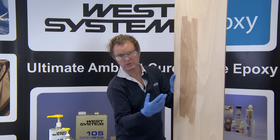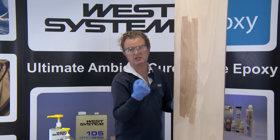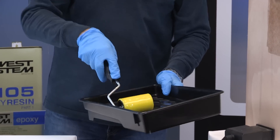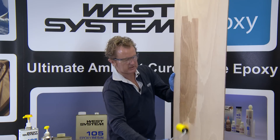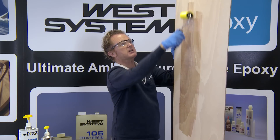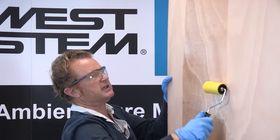You can see a strong color change occurring here — that's a good indication that the epoxy is wicking into all the surface wood fibers, which is very important to achieve a good tenacious bond. You'll notice that the epoxy mix in the mixing pot has a subtle greeny tint to it, but once it's on the work as a thin coating you don't see that.